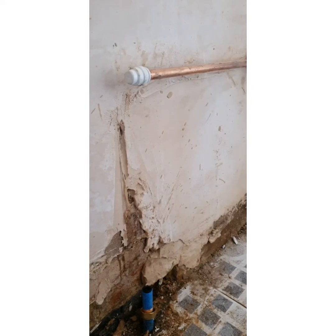Now for the stop tap, what I tend to do is put PTFE on, just to give it a little tighter seal. The best thing to do — I'll do it off camera, sorry — just put the PTFE on before you put it on, just to make that a bit easier for you. PTFE on both sides, so you don't have to do it while you're trying to mount it where the PTFE becomes a bit of a tight squeeze.